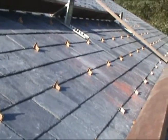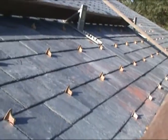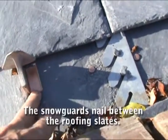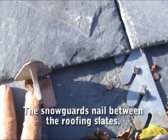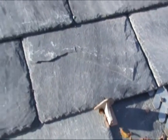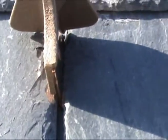But this is what they look like with the roof scaffold still on. When you put your slate down, you nail the snow guard on there, and then just butt the next slates up against it. There's only two layers of copper in there, and it's narrow enough that it doesn't really leave much of a gap between the slates.